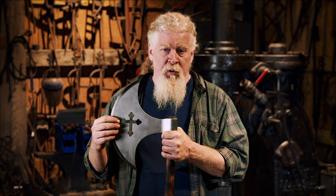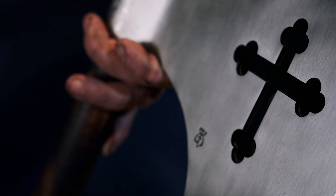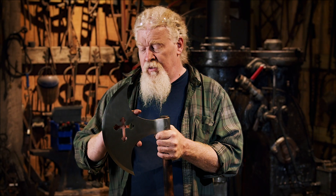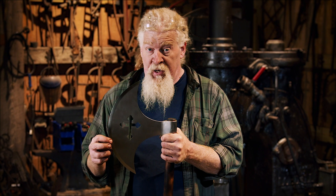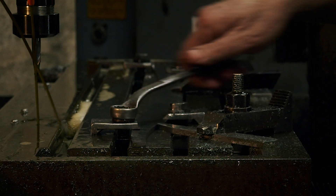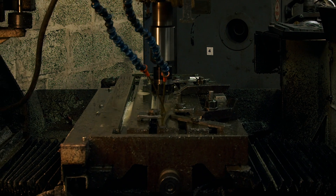We used to cut these by putting them on the milling machine and hand-cutting the crosses in each one individually. We make them in different sizes. But we changed over to having a lot of these blades initially plasma cut, because we have our own CNC plasma table, and then we changed over to having them laser cut because our quantities have gone up. We're making a lot of these things now, so we cut a quantity of them with the piercings already in them.